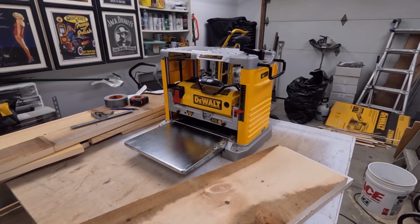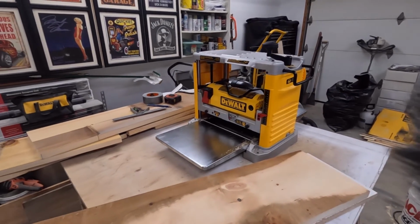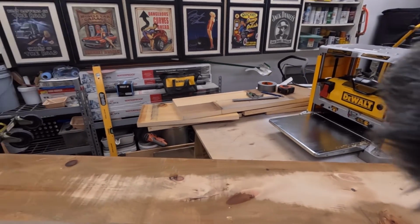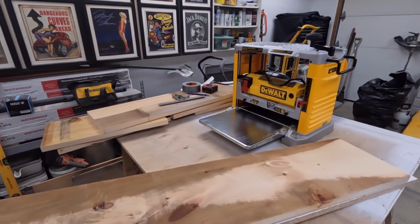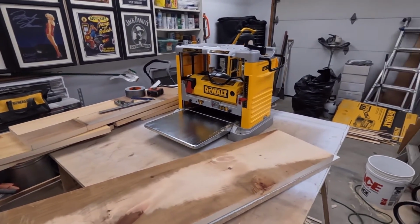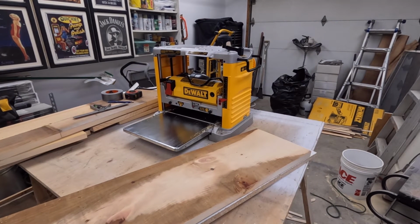We have some contact there, and a little bit of the way up the board. I'm dropping the turret down 1/4 of a turn. Now I just went to an 1/8, and I think I'm not even going to do an 1/8. I'm going to do like a 1/16 of a turn at a time to clean the rest of this off.